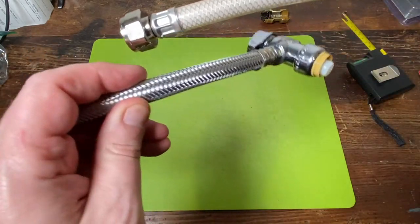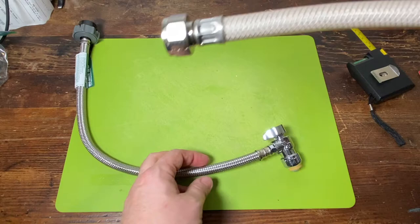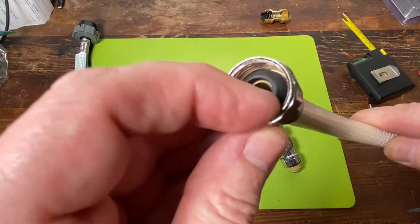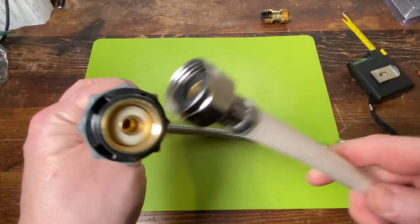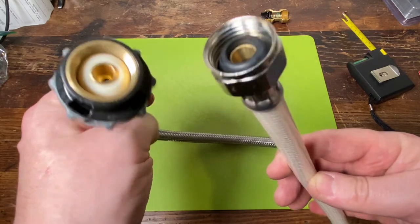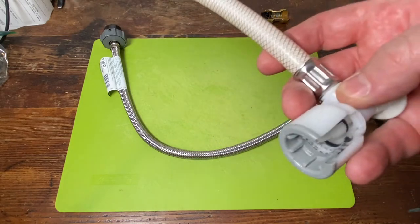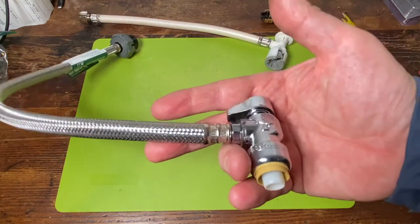Still, it's not as quality as the stainless steel braided line. Between stainless and regular copper tubing, those are two standards I would go with. The fitting is still brass and seems pretty quality. The rubber is actually black - these deteriorate a lot faster than the white ones. White or red are actually going to last longer. Very proven. I just wanted to show you guys inside what it looked like and do a little comparison to something that actually is used today.